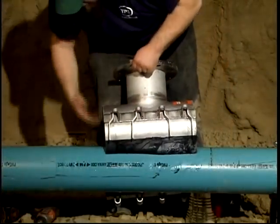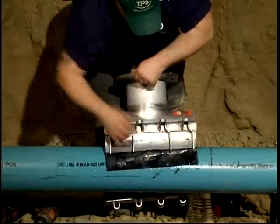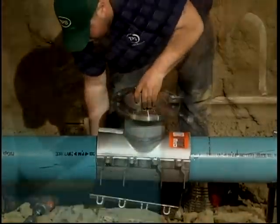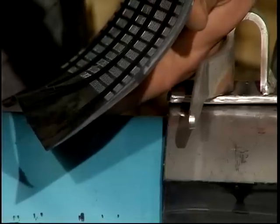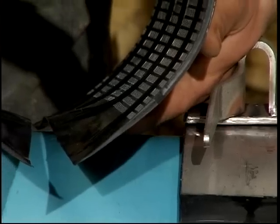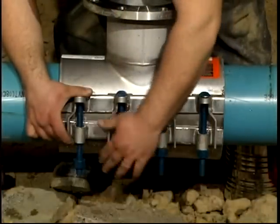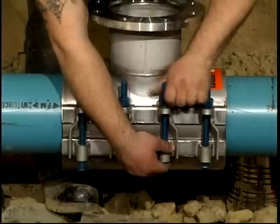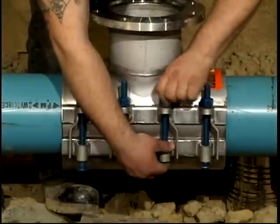The 4, 6, and 8 inch sleeves may be hinged open for assembly to the main pipe. Make sure that the upper gasket end tapers are laying flat against the main pipe. Bolt heads may be oriented in either direction. Now hand tighten all nuts and washers uniformly.